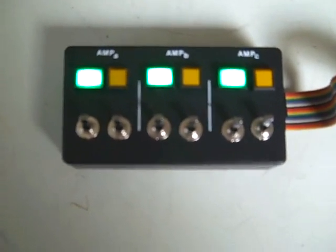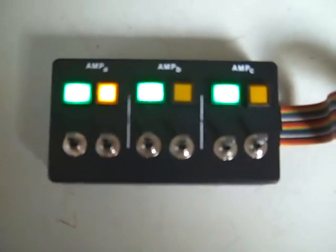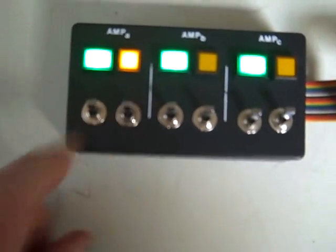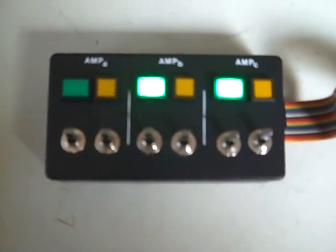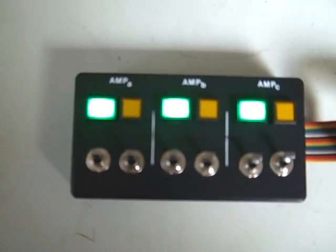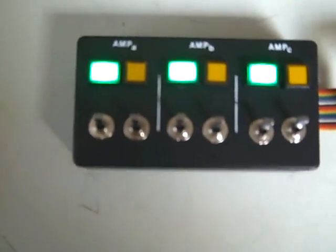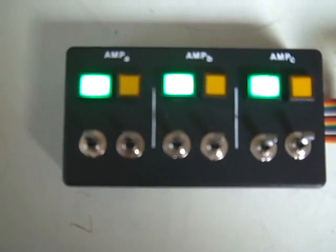Now I'm ready to turn on the high voltage. I'll turn on the high voltage to amplifier A here on the left — okay, it comes on. Now if I've got the power on and the high voltage on and then I turn off the power, the circuit is interlocked so that the high voltage also goes off. If I turn the power back on, the high voltage is still off, because you wouldn't want it to come on at the same time you think you're just turning on the fan and the blowers. So there's an interlock circuit that keeps the high voltage from coming on unless the AC power is on.